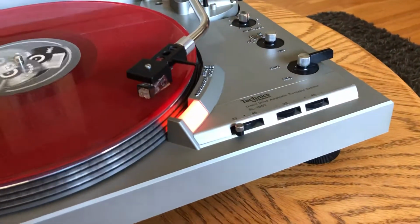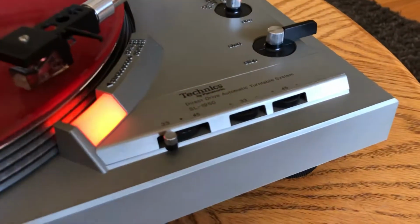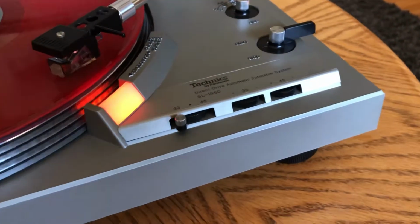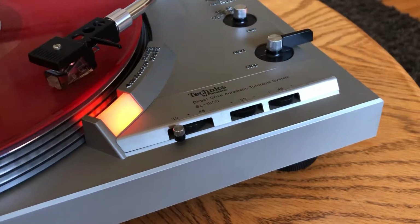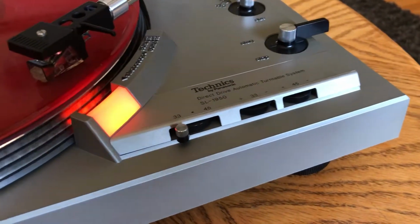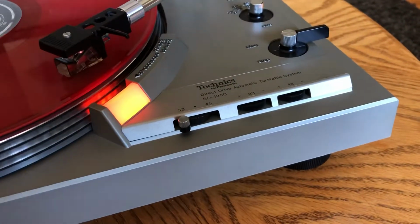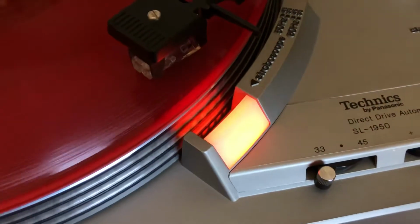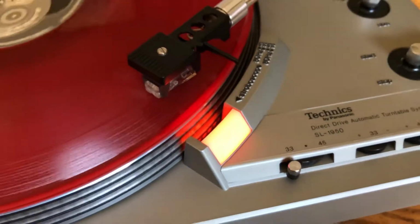Also, like most electronics that have potentiometers or selectors of any types of speed or inputs, they need contact cleaning. I use a lot of DeoxIT to stabilize inside the pots. It will get rid of dirt, dust, and oxidation that has built up over time, and that has given me a very stable turntable speed. As you can see, speed of 33.3 RPMs as it should.